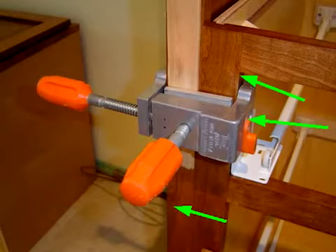If you're serious about this and want to move up to more of a professional-grade type of maneuver, what you need to do is use a self-tapping head screw. What this does is it allows the screw to go through a lot of wood without cracking it. You'll need to go top end for this to work — don't get cheap screws if you're going to try to send a screw in without piloting first.